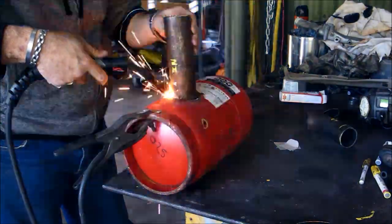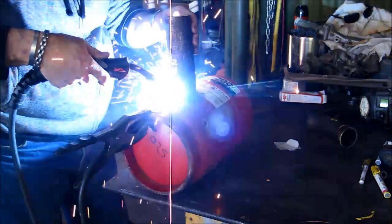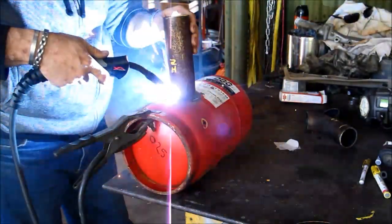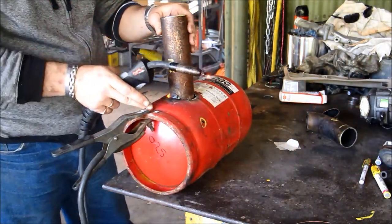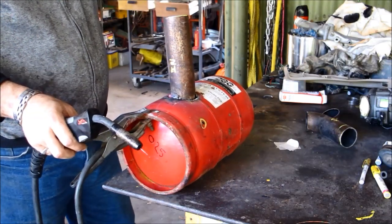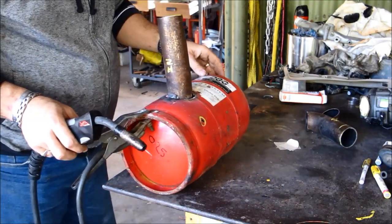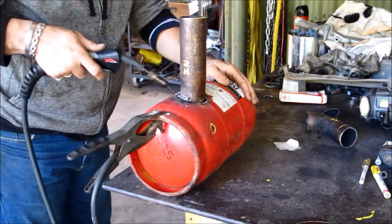When starting the burners it's important not to add too much air or oil too quickly and actually over-cool them. If this happens you'll basically get a flame out and you can just let your blower run a bit longer to cool the bottle off and then start again. Once you get the hang of it they're very easy and quick to light and don't take much effort at all.